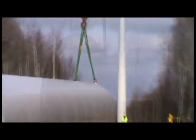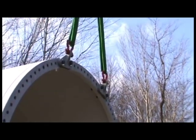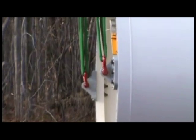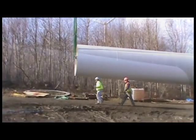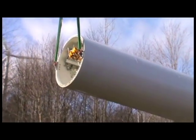The top tower section is lifted by two 20-ton lift brackets with two SlingMax TPXC 4,000 x 20-foot slings and two S252 Crosby 20.5-ton web slingsaver shackles. The tailing brackets and slings are the same as used for the base and mid-tower sections. No snatch blocks are required during the tilt-up process.